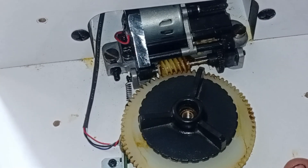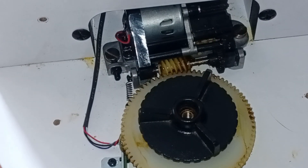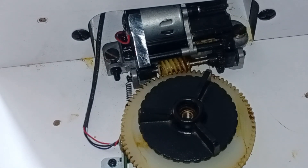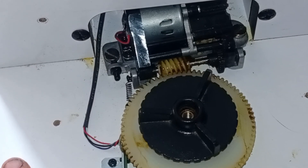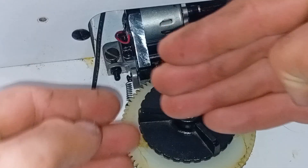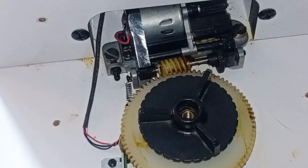Tighten this one so it touches the screw. It's okay that there is a bit of backlash because not all backlash is bad — if the motor is too tight you will break something. The important thing is it's not going back and forth. This is acceptable play.